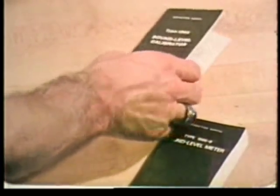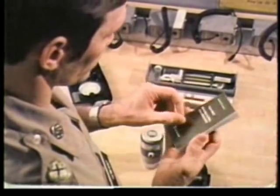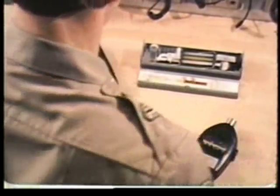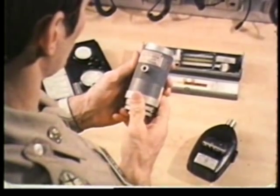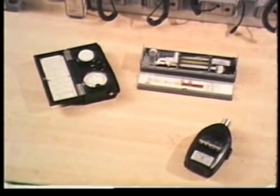In the calibrator instruction manual, there are correction tables that should be used if you have to correct for atmospheric pressure in areas of high altitude. The calibrator itself must be checked for accuracy at least once a year by an authorized lab. The inspection sticker will show you if the instrument is still current.